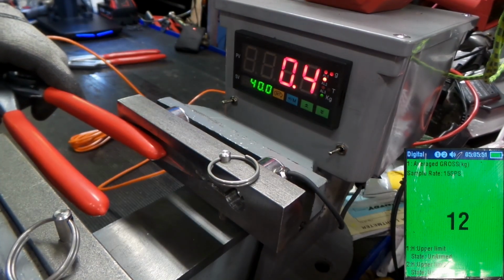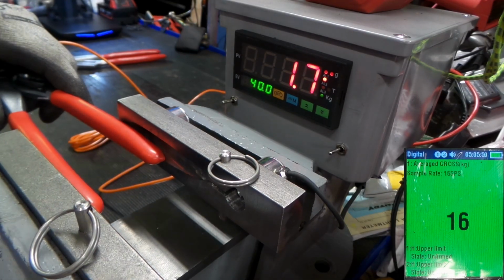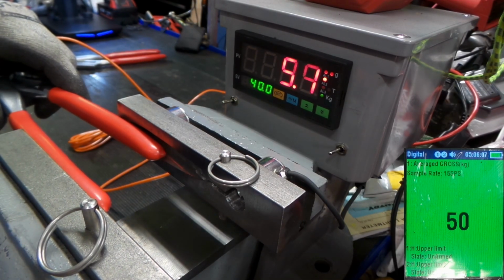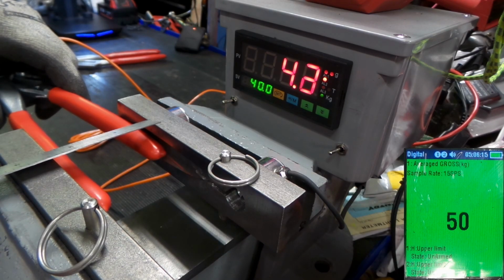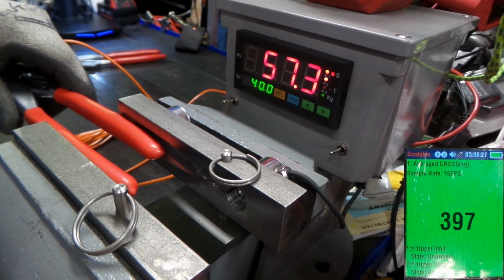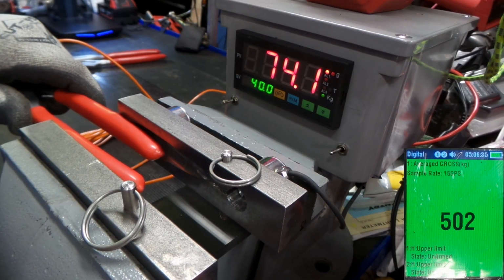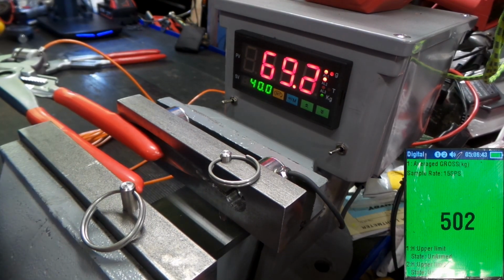So to start out, I happen to know that we want to get to about 75 on the load cell in the vise. So what we're going to do is start at 5 and see how much force we're exerting. Okay, so 5 is 50, and we're going to measure. Okay, we're 2 3/8, and now we're going to crank this up to 75. Right there, about. Kind of backing off quick, the pliers is stretching. But we'll go with 75 there, 1 3/4 and 500.